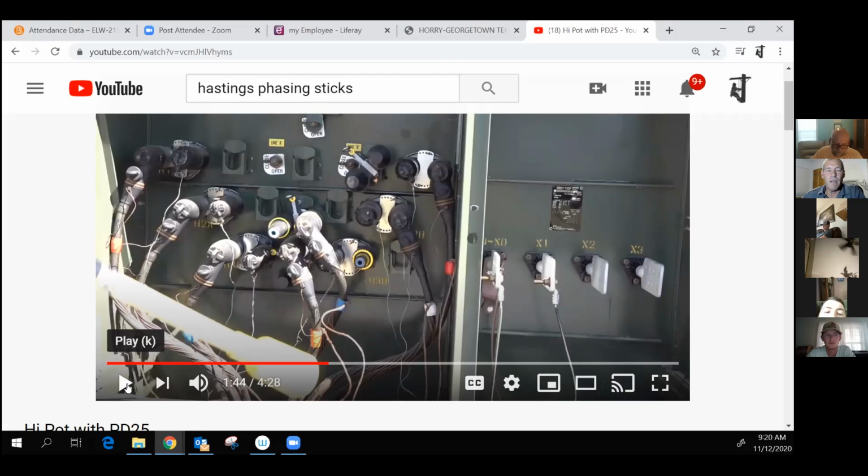I've seen plenty of linemen moving elbows who will do exactly what Professor Vermeulen said: could you hold that wire out of the way? Or, could you get this thing cleared up before I pull the elbow off? So just be safe. This is tight. Yeah. The other part of it too, and not to say that I would want it to ever happen, is if a fault occurs in this spot right here, gentlemen, it's focused towards you. What do I mean by that?